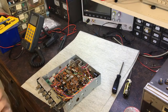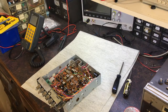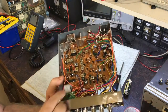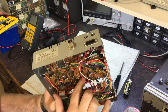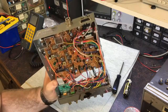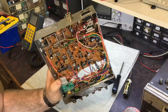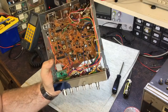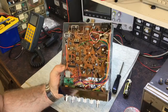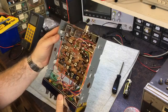Just one side. So yeah, there's these parts. There's a capacitor standing right off the board there. Got a long way. And these have got quite long legs on as well. These two here. So is that one there. Over here, it's not good. Over here, all quite long. When you're dealing with RF stuff, RF leaks and everything, you've got to keep everything as short as you can. That's not great in itself, I suppose.